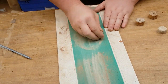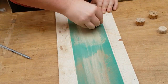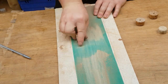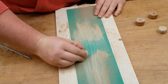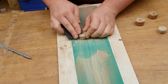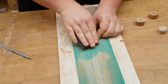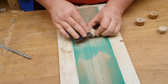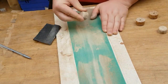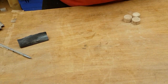What we didn't film here was using the pillar drill just to drill a hole that will take the shaft of the potentiometer. I'm using CTS pots here so they needed a 6mm hole — they would have wanted a quarter inch but I only had a 6mm or 6.5mm. The 6.5mm was too loose so I used the 6mm and it works nicely. They're knurled shaft potentiometers so they fit themselves on really — the knurls will make the grooves in the knobs and they fit well. I wouldn't want to be putting them on and removing them too much but they'll work perfectly fine.